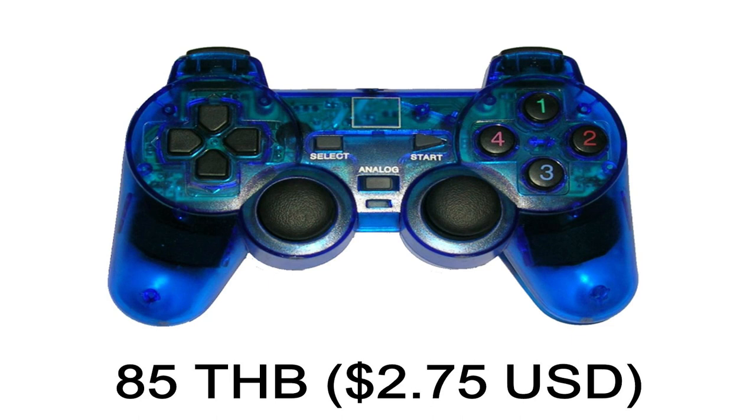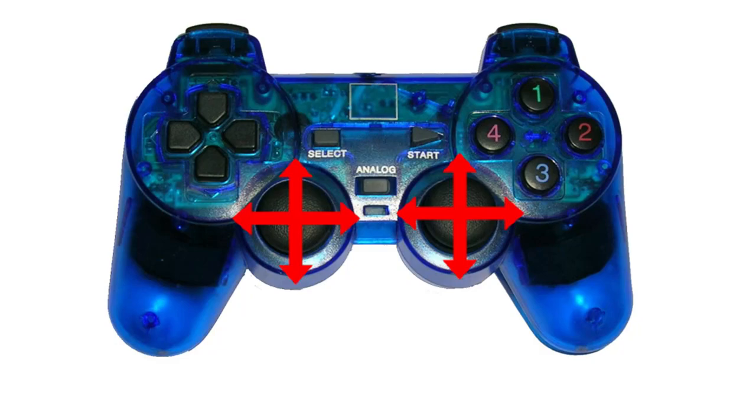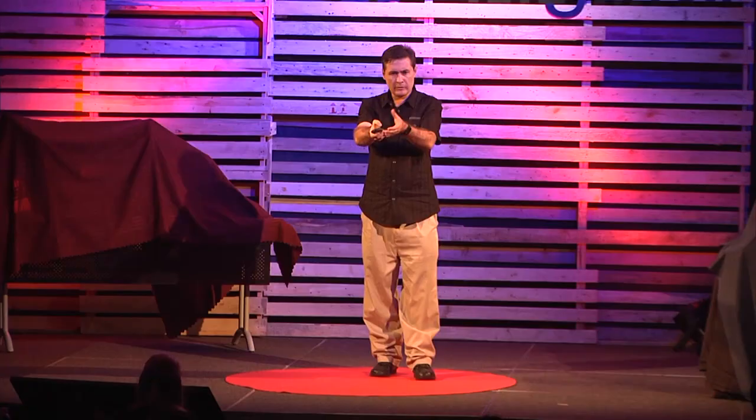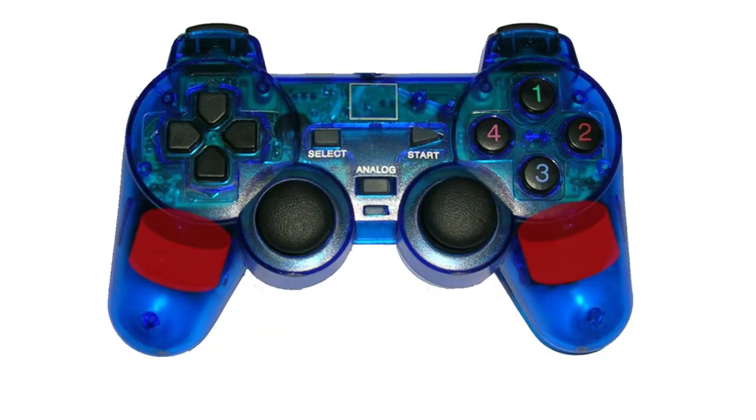The computer would simply think you were pressing buttons on the joystick to play. This joystick cost about $20, but here in Thailand you can buy a USB joystick for about $2.75 US — about 85 baht. So what do you get for your 85 baht? You get 16 buttons — simple on-off switches — and four analog inputs: the up, down, left, right joystick axes or thumbsticks. You've also got two outputs: two rumble motors. Normally they're inside the joystick, so if you crash your racing car into the wall, the controller vibrates. We call this haptic feedback.